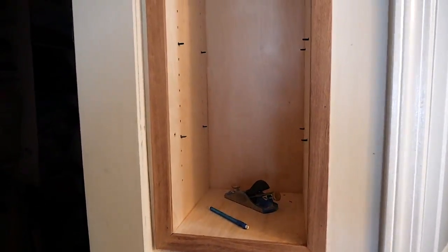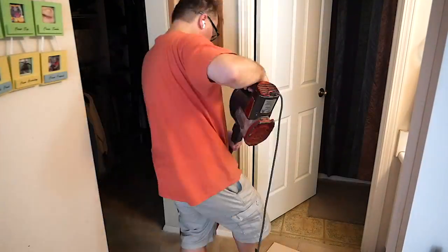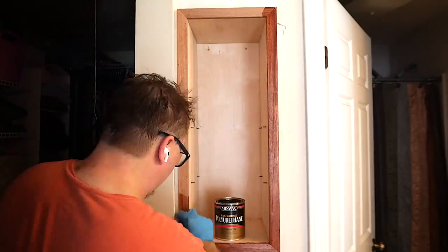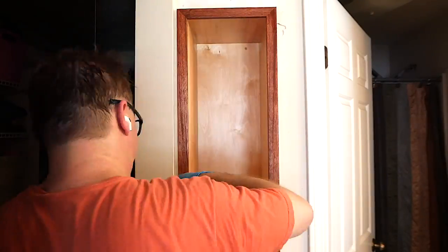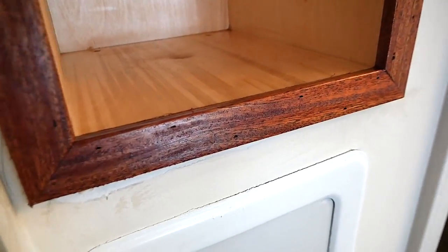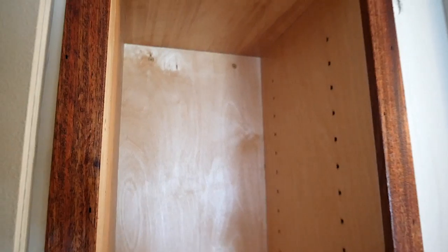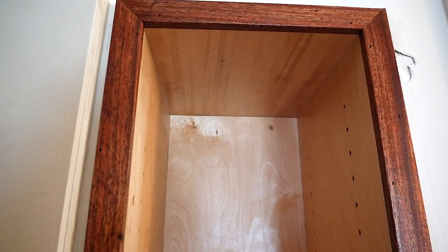Here's a glamour shot of the more or less finished carcass with the trim work. After a little cleanup with the vacuum cleaner, I decided to put a coat of polyurethane on — just using regular polyurethane, wiping it on with a soft cloth rather than a paintbrush or foam roller. The addition of the polyurethane really brings out the color of that mahogany and causes the wood grain and the Baltic birch plywood to really pop. I think it really took this project to another level — very happy with that decision.